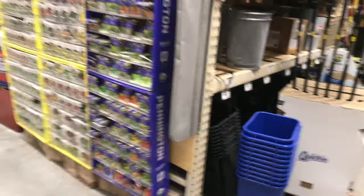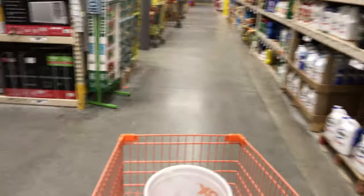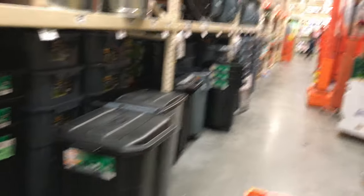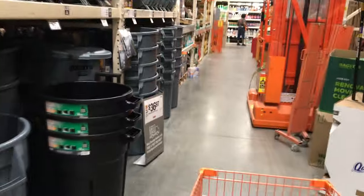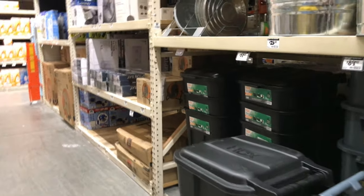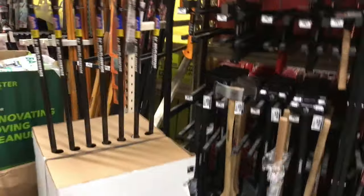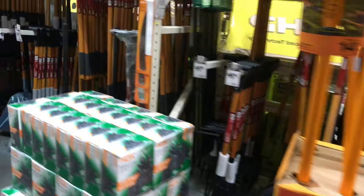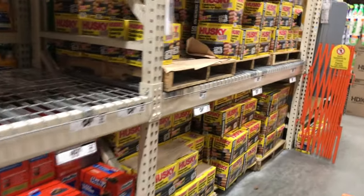Alright guys, that's pretty much it. I don't need anything else — just a little walk about. I got the HVAC thing. So basically in my previous video it was the breaker — the guy came out and just pulled that 50-amp breaker right out without cutting the main source power, flapped the new one in, I hit the thermostat and the HVAC condenser kicked right in. Win-win. It may have cost me some money, but it just goes to show you — you think it's the HVAC acting up but it's just the freaking breaker switch. Those things never get serviced once they're installed, and the switch was probably like 25 years old. Once I moved it to turn it off to clean the outside coils, it probably was all rusted inside and just fell apart.